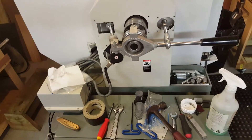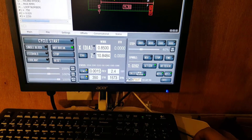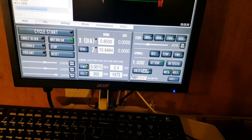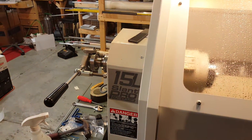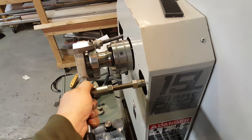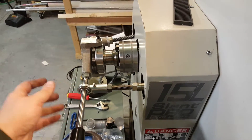That makes the movement a lot more snappy, as you're going to see. This basically took me an afternoon to do, and it'll probably take me a day to clean up the mess I made. If you have a Tormach slant bed lathe, you probably noticed this button right here — open/closed. I actually probably put a little bit more pressure on here because it slams a little bit harder, and it also slams open a little bit harder which makes pulling the bar stock a lot more reliable.